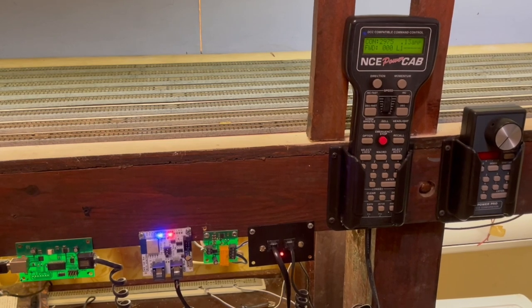The red and blue LEDs quickly light up. The red LED tells me that I have power in the WFD-30. The blue LED shows that the WFD-30 has a physical connection to the power cab system. There is also a green LED which flickers intermittently whenever there is Wi-Fi activity.